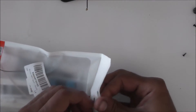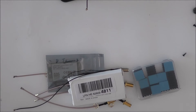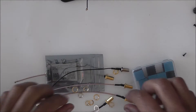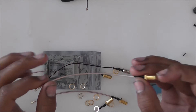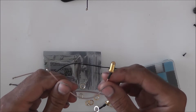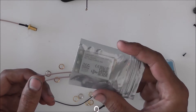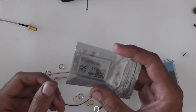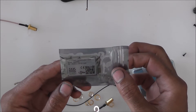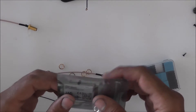So in this bag I have a couple of subtle upgrades, nothing too spectacular. I have a new, or let's say a better, antenna connector for the LoRa chip. I did also buy an upgraded LoRa concentrator — this is a 1303 chip, which is far superior to the 1302 module. But I'll talk later about why I cannot use this.